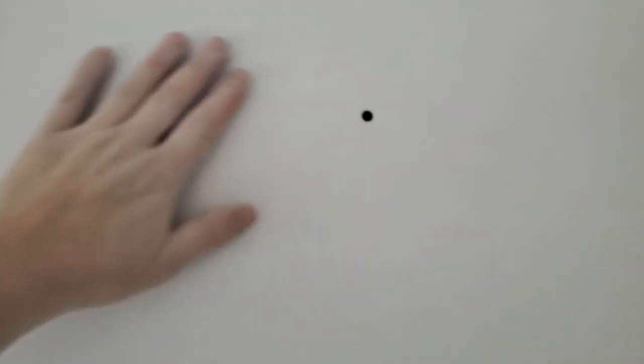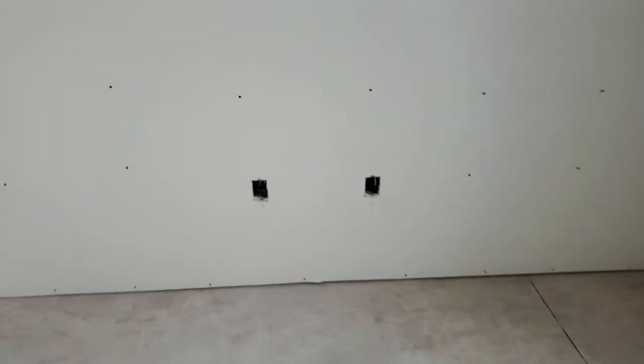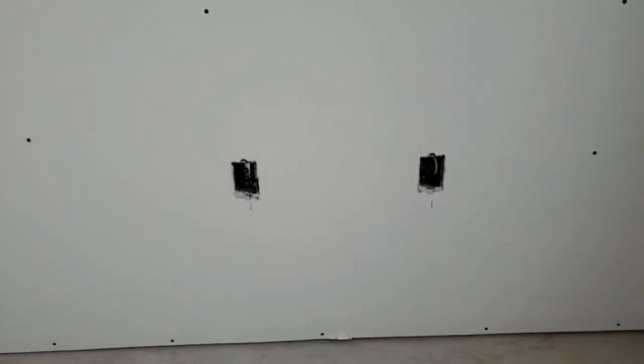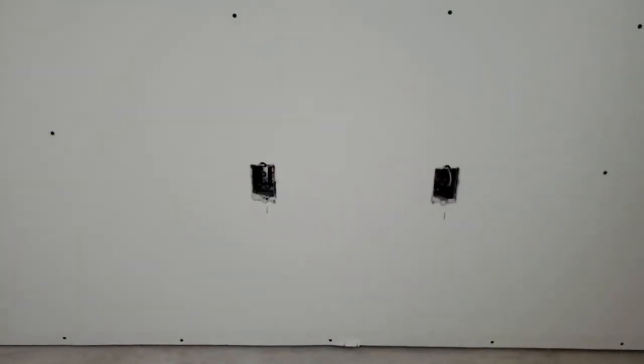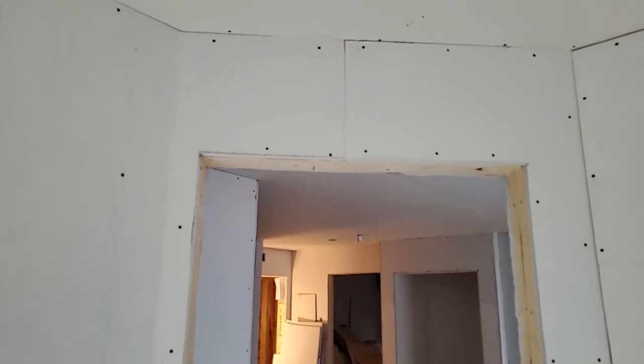Corners are screwed off, like we check all the screws, make sure you don't see any sticking out. All the tops are screwed in, all the bottoms are screwed in. You don't screw in close to the boxes, you keep them away, because it's a nightmare for taping, and especially before you router them out, you want to make sure the screws are way far away so they don't pop out on you. But other than that, yeah,